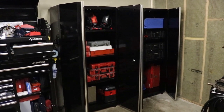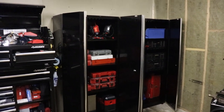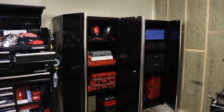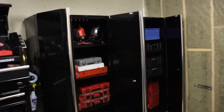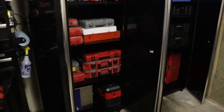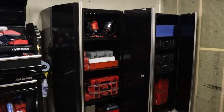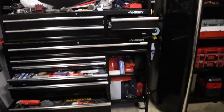Definitely don't tighten the back until you have the doors on, and I think you're good to go. If you have kids around, definitely strap it to the wall — if someone tries to climb those shelves, they'll be squashed pretty quick. You can probably put the lag bolts right through the holes in the back into the wall with some washers — that might be better than using the strap, since the holes seem to match my studs perfectly. Definitely should be mounted to the wall. Remember the Ikea bookshelves that were tipping over on kids who climbed them? Same idea here. Thanks for watching.